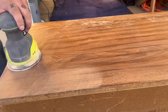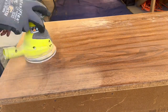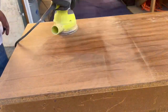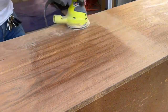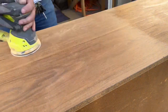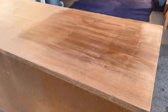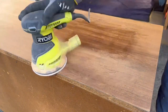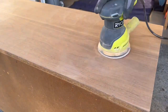Once the top has had some time to dry, I go ahead and start sanding with 150 grit sandpaper followed by 220 grit as my final stage. Any higher in grit can cause the grain to seal itself and not accept stain very well, so keep that in mind before you try to give it too fine a sanding. For light scratches and gouges I tilt the sander slightly on its edge to help remove those scars, but this is very risky when working with veneer — be sure not to stay in one spot too long or apply too much pressure to keep from blowing through the wood.